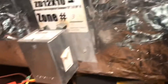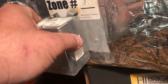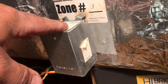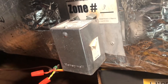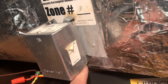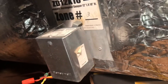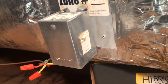This Honeywell here — when called from a 24-volt call from your thermostat, these are normally open. And when this zone's not calling, this is supposed to close. However, the motor's stuck. You can hear it clicking, and it will not close when it's satisfied. So they're getting constant air going to their downstairs kitchen.